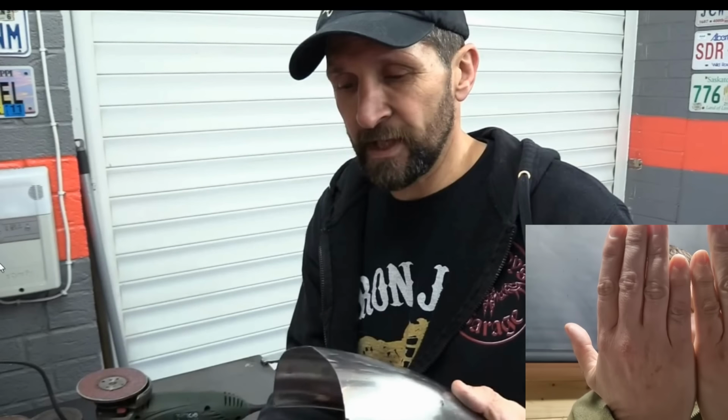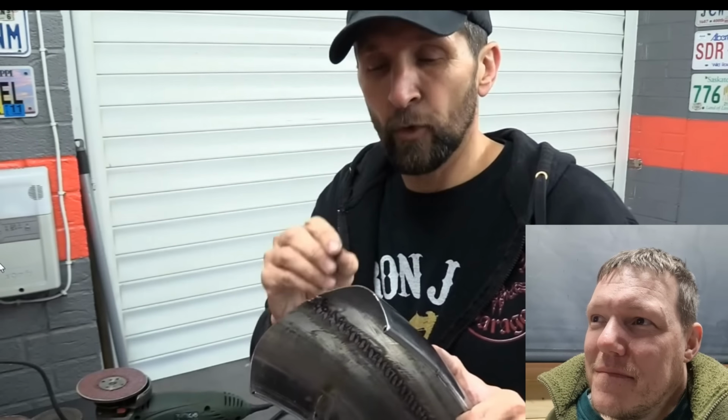A lot of the time when you butt weld, you leave a gap. For sheet metal, you pretty much want it butted together spot on. With MIG welding, it's not bad if you have a tiny little gap, because then you guarantee penetration, because you don't really have that much control, as the wire just feeds regardless. And yes, you can fiddle with the speed control.